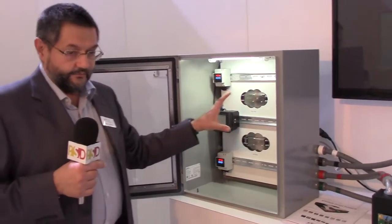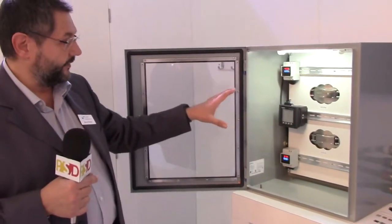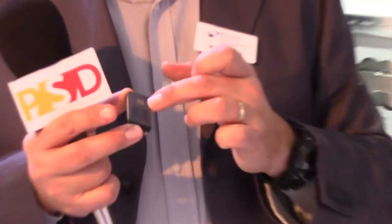So that's pretty much it. The real advantage is that when it comes to the input source, it can be handled by a very small and compact front-end that leaves all the space available for your electronics — you don't need to worry about the size of the power supply or the cooling. This special package is also part of the story. The components we develop are born in what we call the CHIP format — a converter housed in package — which allows an optimized production cycle with less material waste and high component density. All components are placed on a PC board.